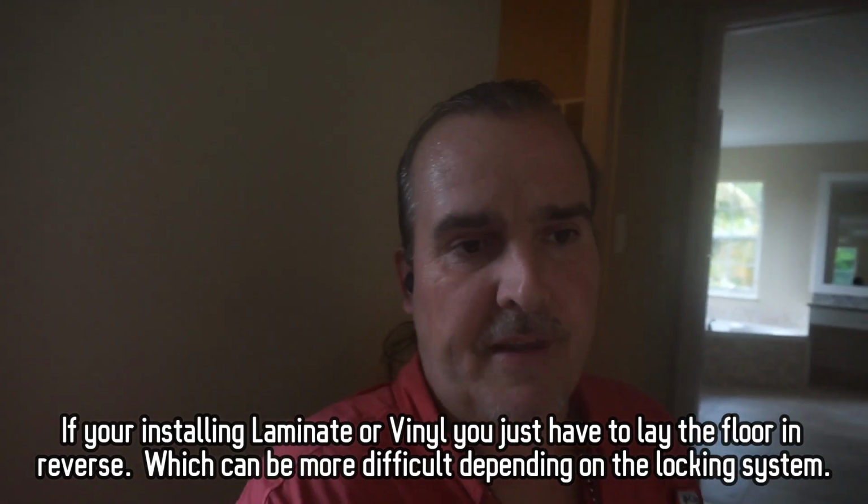Therefore, when you're deciding where to start, you want to lay it out in a way that you won't have many of those backfills. We don't want to have 6 rooms that are behind us. It's just not productive. So keep that in mind when you're starting the floor. You want to get as much of the job in front of you, not behind you.